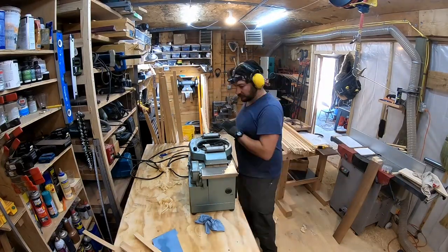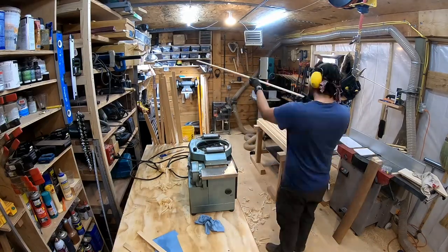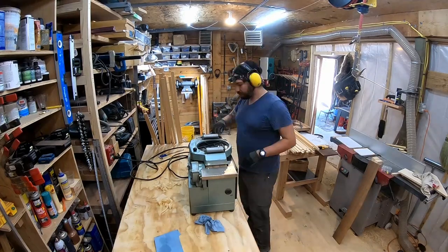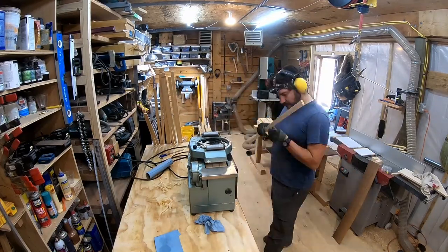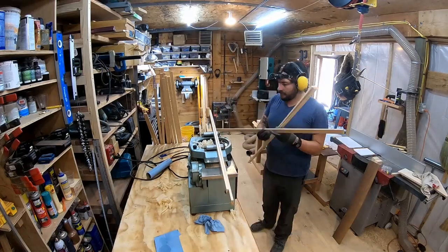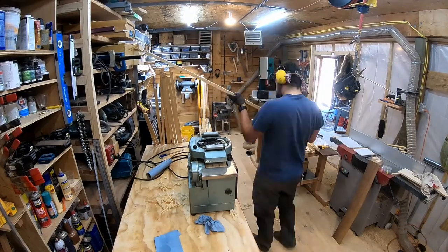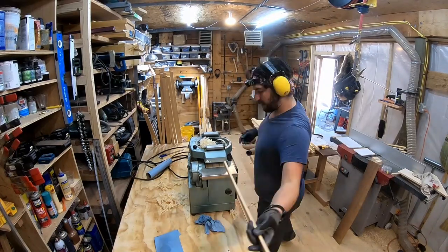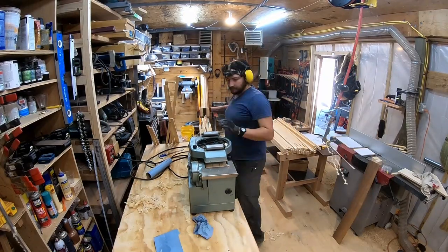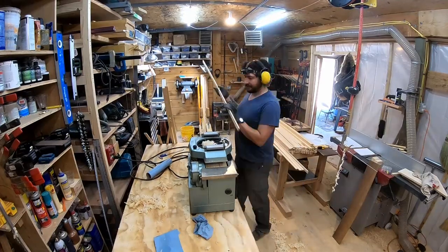And once all the pieces are done, all the joinery is cut, then we're going to plane down all the pieces. So I'm using my little super surfacer here. I've since sold this machine and I have a much bigger one, but I'll send all the kumiko through, plane those down, and then we'll send all the frame parts through, clean up all the layout lines that are on the frame, and prep those for assembly. On larger pieces, I'd be using the hand plane. I just happen to have this tool, and it was nice and sharp, and it made everything go a lot faster.